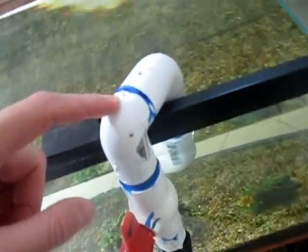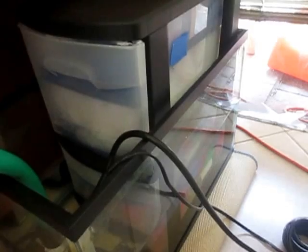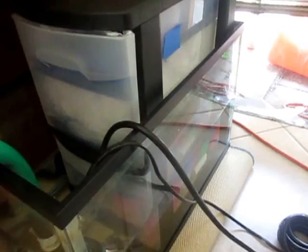Not only that, but you have to take into account all the bends and elbows — they cause a lot of friction. On the bottom of all these shelves are holes to make my drip plate so the water will trickle down. If there's not enough holes, the water is going to start piling up higher and higher and overflow. If there are too many holes, the water is not going to pile up at all and it's not going to evenly distribute over all the media.